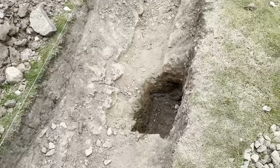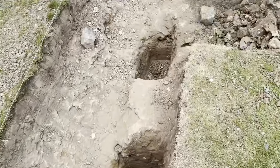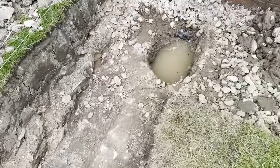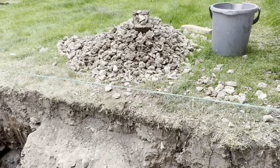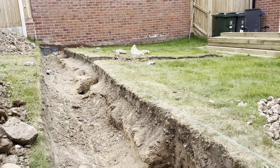I did end up with some inconsistencies with the holes because the ones closest to both garages on either side had quite a lot of hardcore near them, so they ended up either full of water or full of loose stone, making them a little trickier. I also set up a string line across the garden from one garage to the next so I could get a perfect level for each of the sleepers.